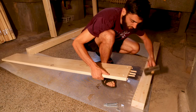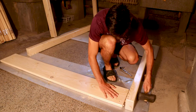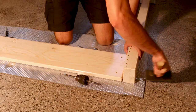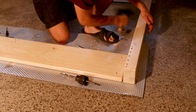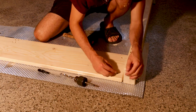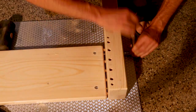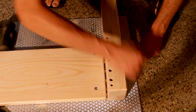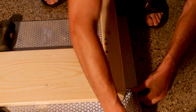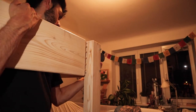And now we can finally assemble the bed. I'm starting with the front and back using three 12 millimeter pegs and hammering them on with a rubber mallet. Then I'm putting in the barrel nuts and the M8 bolts and using a ratchet to drive them home, tightening nicely and closing the gap evenly. The final assembly was done in place and is pretty self-explanatory.